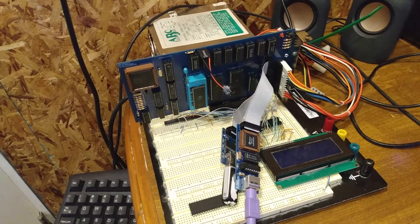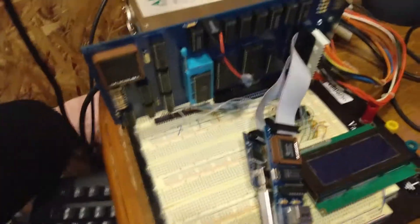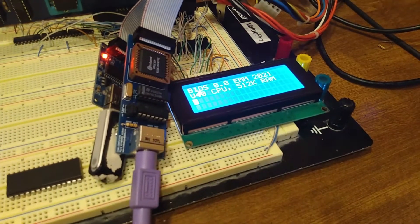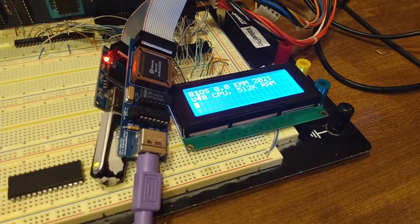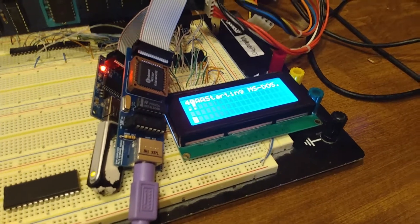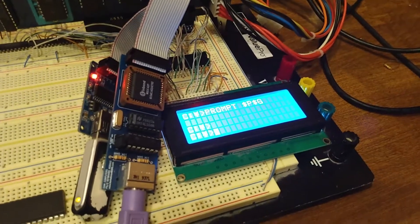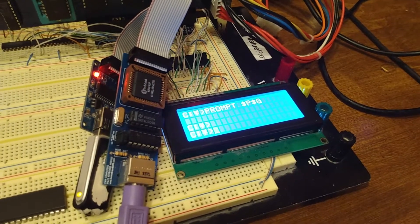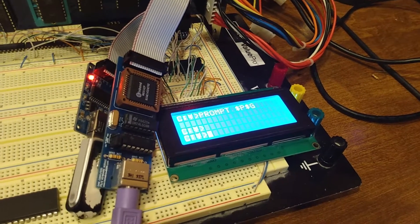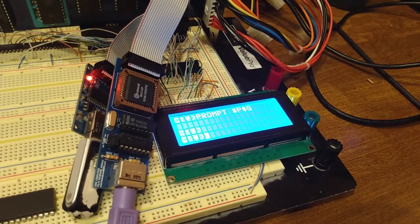This chip here is just an extra ROM that I use — I swap them back and forth when I'm prototyping. So I'll turn it on here and we'll give it a test. You can see it fired right up. When I was paused I did not have to tinker with anything to get this to work — I did test it beforehand just to make sure it wouldn't crash during the demo. Starting MS-DOS — you see that 40AA? That's a report from the keyboard controller saying it's on and working. The AA is what you want to see. Typically you'll see 00AA on the keyboard.